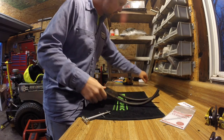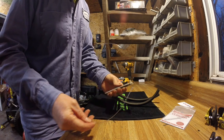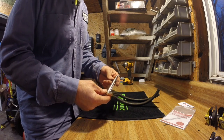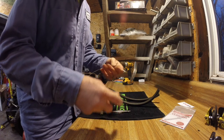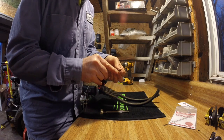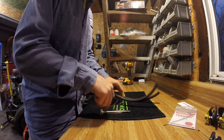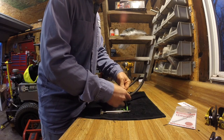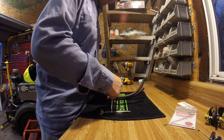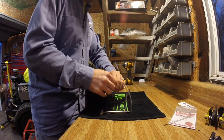The hose is on there, then I'll cut it to length. You take your wire — this is .041 stainless wire. In the kit you get a roll of wire and a tool, or you can buy things individually. Their website link will be in the description below. It comes with a wire nut if you want to use that — you just even up your ends. You cut enough wire to wrap around your piece four times plus add a foot. I'm going to do a double wrap on these — there are several different wrap styles you can do. Forgive me because I've only used this tool one time before.